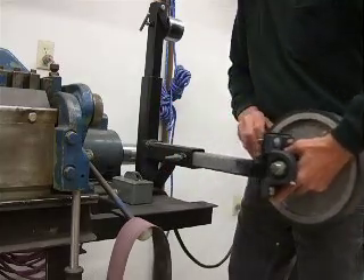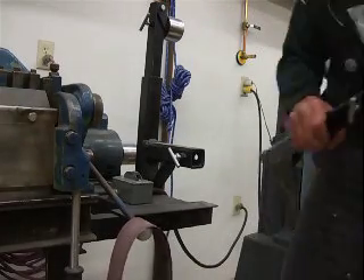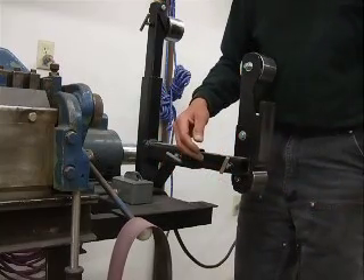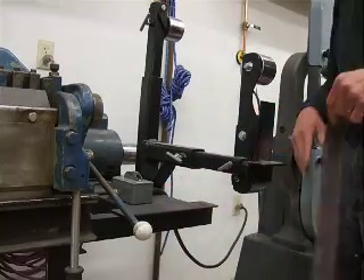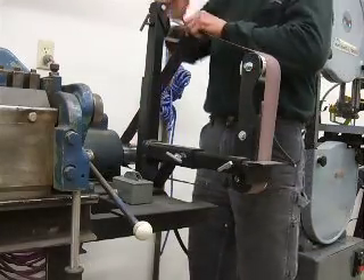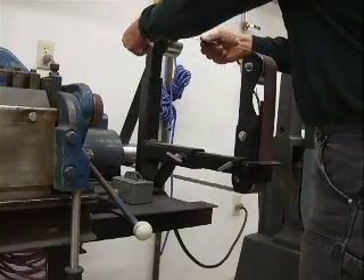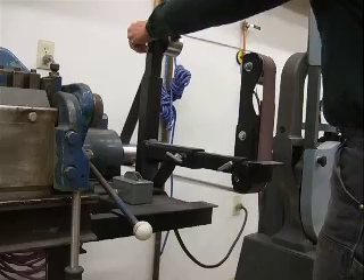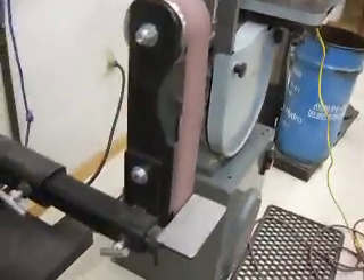Take your little pinch bolt out — that's just a regular bolt with a piece of quarter inch round welded to it. Take this, put that in there, it goes to the end. Tighten that up. It's got a little rest I made that you can take off. Then take your belt, drive it through, press the spring, and voila. Now I just have to adjust the tracking because it's a little different. Now you've got a 2 inch belt grinder with a platen on it and a little rest.